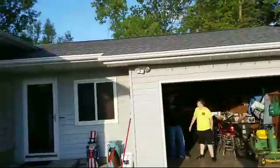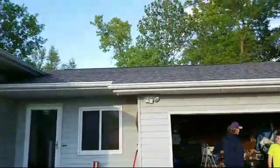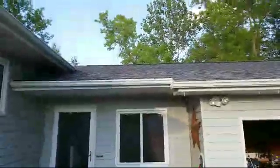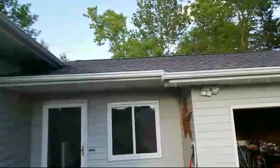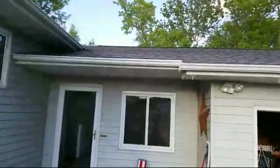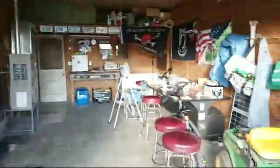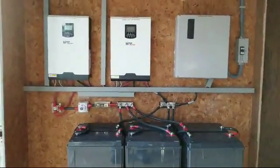There's a little satellite up there that has the internet connection - they're all connected. We're going to be putting the DC lighting panel over there. Stevie, check this out - this is where the panel is going to be for the DC lighting. The DC lighting is going to be around this place right here, where the panels are going to sit right there. Because up through winter time he knows it's going to be constantly cloudy, so we can still pick up sun - we're going to use monocrystalline solar panels trickle charging those batteries. This garage runs on about a 20-amp breaker.